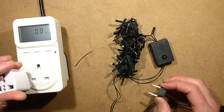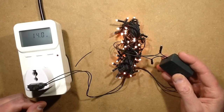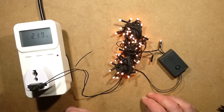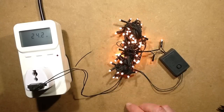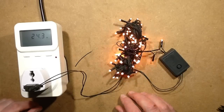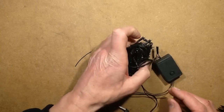Let's bring in the power adapter and power meter. Setting them to static mode, you can see that even for tungsten there's quite a lot of flicker. I can see that shimmer, which suggests to me that these are being driven half-wave — it's not being fully rectified in there, just something simpler. The power when they're all on is 24 watts, which compared to the LEDs is quite monstrous. I fully believe it is 24 watts because they get quite warm in operation as well.